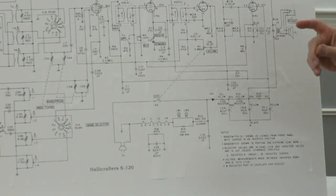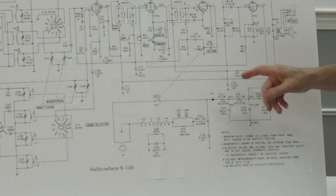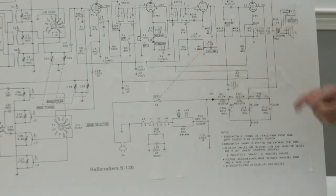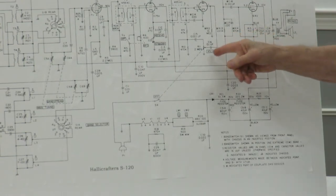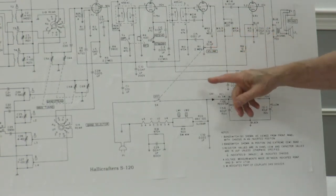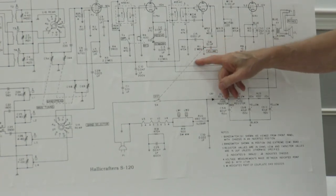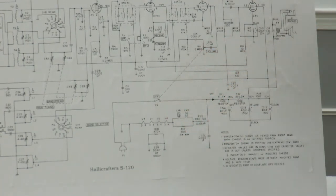But before I use that, and say now, if I use that, and this resistance, potentiometer goes dead, now what am I going to do? I have to have a fallback. So I will put that in there until I have a fallback. Because you not only have to get a 2 meg audio taper pot with a switch on it, with the right length shaft, with the right end on it, with all the other right stuff that you have to, and look at those odds, and I've got a bunch of them, but none of them ever seem to fit right.